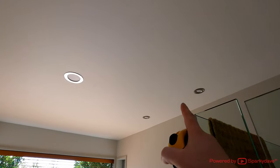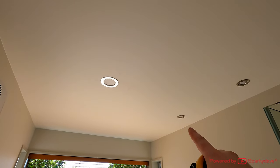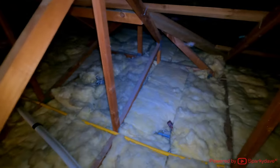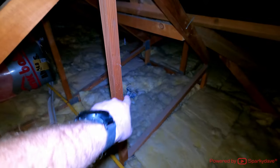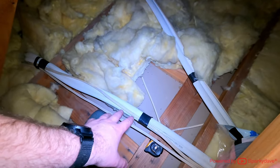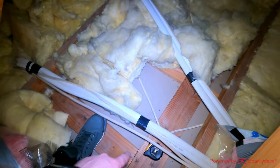Before jumping in the ceiling, make a mental reference of where things are that are easily identifiable, so here I've got two small downlights and a third big downlight. We want to note the structural layout of the top plates in the ceiling because that's what we're going to have to locate. The ceiling access in this house is just on the other side of the wall. Up in the ceiling, I've found the big downlight just down there and the two small ones located there and over there. Therefore I know the top plate I'm standing on and the adjacent top plate is the corner where the shower is located, so we're going to use this corner as a reference point.